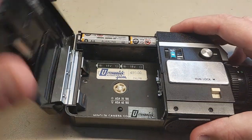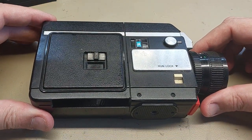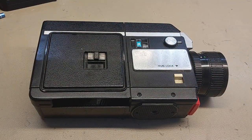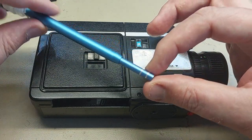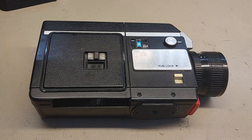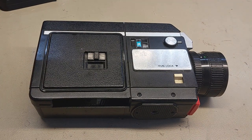So I think I've cracked it. I need a close-up camera mounted in the optical path in the position where it focuses perfectly, and I think I can do that. I'm going to try it from two angles: I am going to try taking one of the Pi cameras and focusing it in close, but I also have a high resolution one of these on order. This one is 640x480, but at around the $15 ballpark you're into 1024x768 which is nominally high definition. I've got one of those on order and I'm going to try it and see what happens.